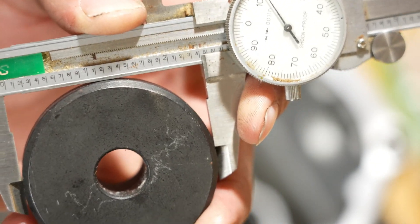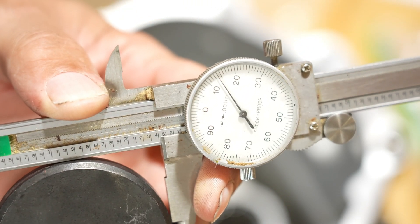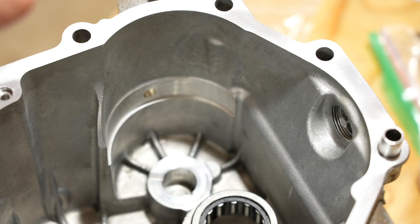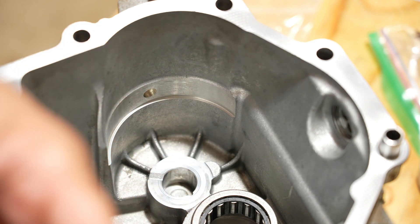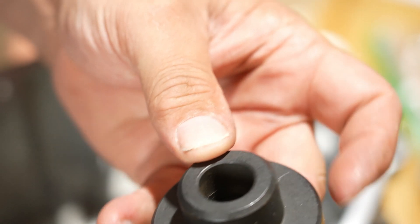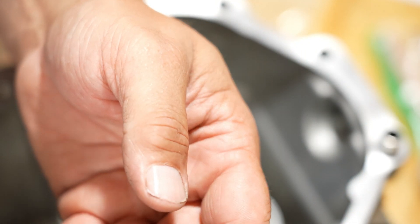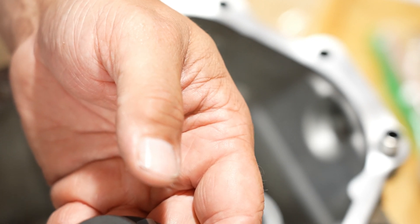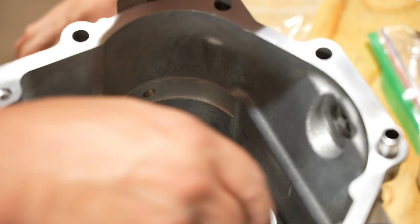So you've got two inches and four hundred fourteen thousandths. That measurement doesn't matter so much, but this one will matter. You technically probably don't need this measurement here — you can probably do it with a flat driver. It measures one inch three hundred sixty-two thousandths.